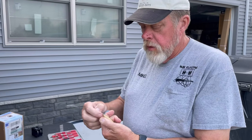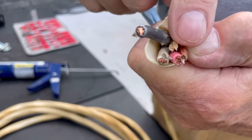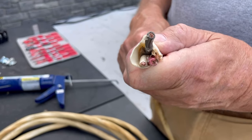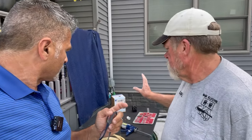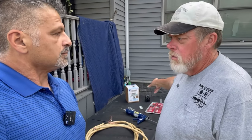The ground wire is the same size as a 30-amp wire — you can see how much larger the 50-amp conductors are by comparison. They're stranded because at that gauge stranded copper carries the current better — more strands means better current capacity. This wire is rated for 55 amps. Our first process is to get the box ready, prep the wire into the box, hook it up in the box, drill the hole in the wall, route the wire in the crawl space, then mount the box on the wall.